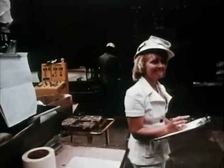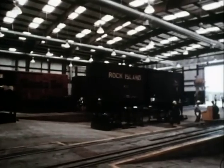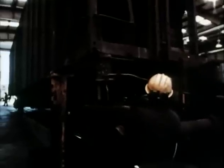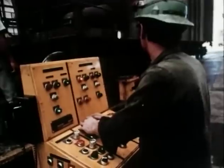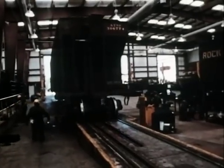Barstow's car service facility is a railroading man's dream. It's a one-spot facility. Cars needing repair are brought to the servicing men and equipment. Here, they can make wheel changes, repair draft gears and couplers, replace body center plates, and carry out the most exacting inspections, handling up to 78 cars and 12 truck changes a day. So cars coming through Barstow are not only kept moving to their destinations more efficiently, but they leave in good shape.